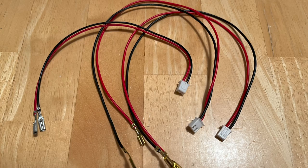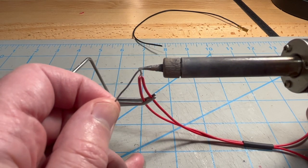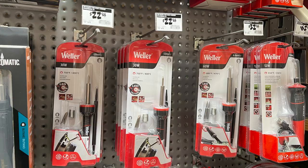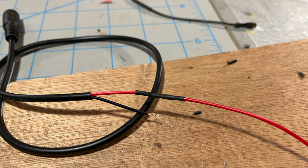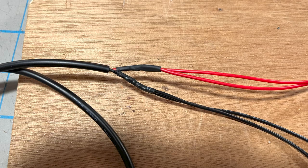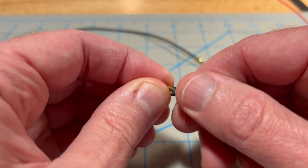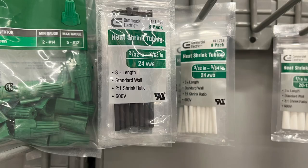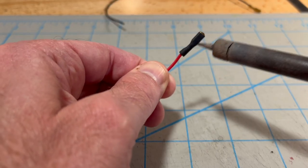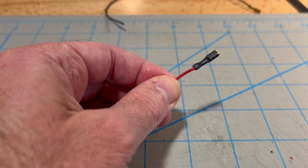The push buttons don't come with power connection wires, so I made my own harnesses using the three spare encoder cables and two of the 2.1mm pigtails. This part of the project requires a bit of soldering. If you've never soldered anything before, don't panic — you can purchase simple soldering iron kits from places like Home Depot or Lowe's, and some even include the solder. If you can twist two wires together and hold your hands relatively steady, you can solder just about anything. I made a single power harness for the red launch button and a dual power harness for the white flipper buttons. First, I clipped the JST connector from one of the spare encoder cables. Next, I slipped a small piece of shrink tube down each leg of the wire to insulate the exposed ends of the spade connector. Shrink tubing shrinks when you apply heat to it — Home Depot stocks it in the electrical aisle near the crimp connectors. I used the tip of my soldering iron to heat the tubing, shrinking it snugly around the exposed metal parts of the spade lug to insulate them and prevent accidental short circuits.